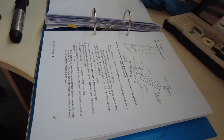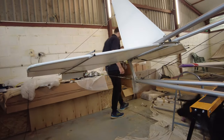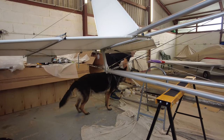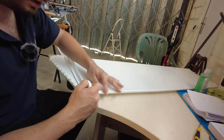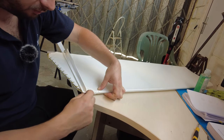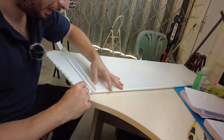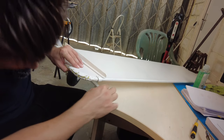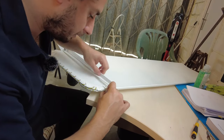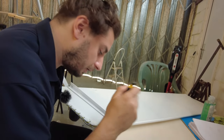Put in place the bracing angles and secure them lightly with a 6mm plain shank length bolt through the hole. I need to find the bracing angles now for the rudder — I think they're here. So we've got a horizontal support brace inside the rudder. This needs to sit just behind this bar and just below the horizontal support brace. This goes in between — you pop it on like this — and this goes on the other side, and this goes over the top. It's just about getting it absolutely bob on and then making a hole for it.